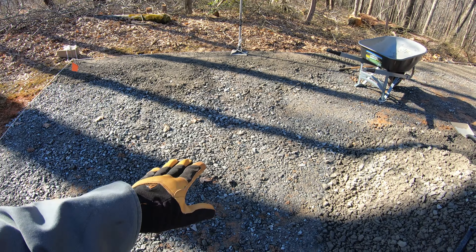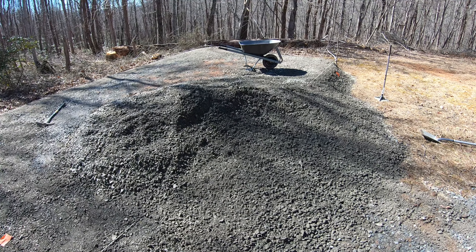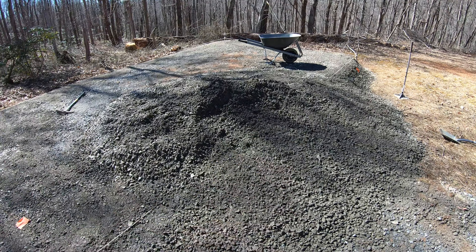That corner is a challenge — it's hard to get material back there. I'm also starting to build out a little bit of a ramp going up into the barn. It'll be a double six-foot wide barn door on this side, so trying to level it off. I may need to put some sort of drainage — a culvert or drainage tube — so water running along the side of the barn can pass off into the woods. The problem is he dumped all the gravel right where I need to dig out for that, so that'll be a future job.